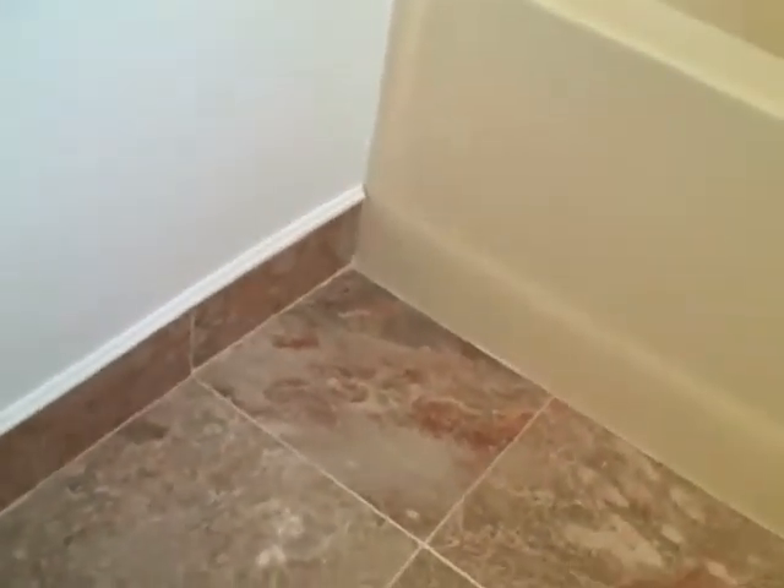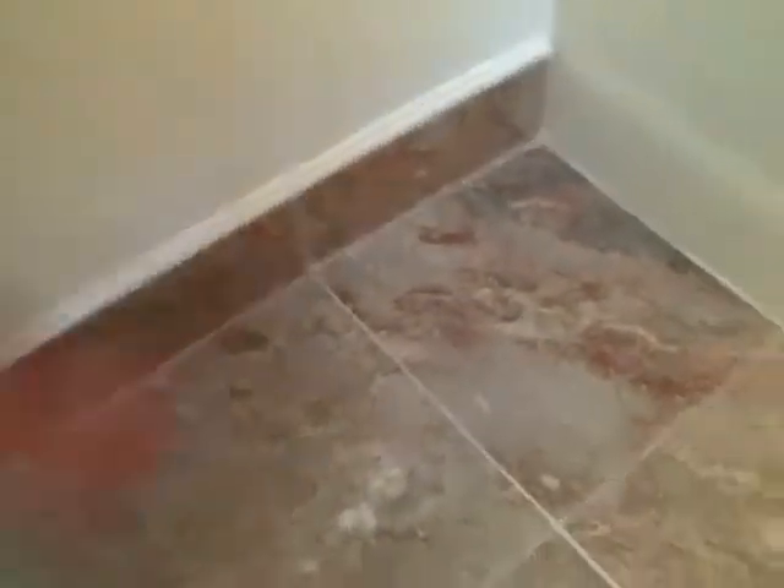There's a lot of work — actually more work than I thought. The easy part was getting all the stone. I laid everything out, glued down all the stone, then cut all the other pieces to fit, cut all the side pieces, put the grout in, and added a little molding on top. I put a little 45-degree miter in that particular piece right there, and it just came out so beautiful. Every single one of these pieces is just so beautiful.